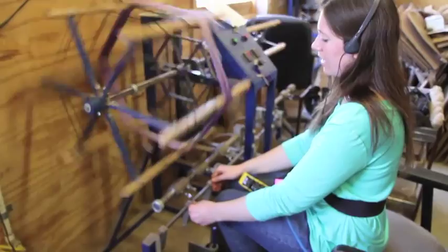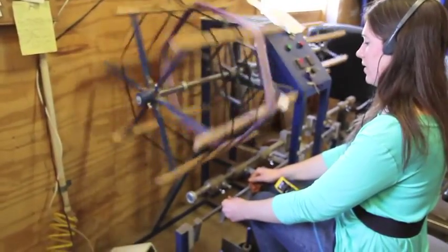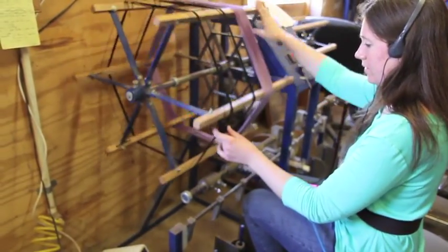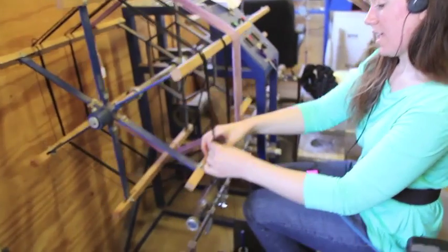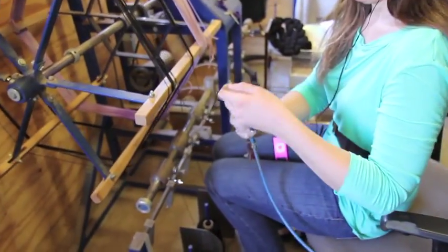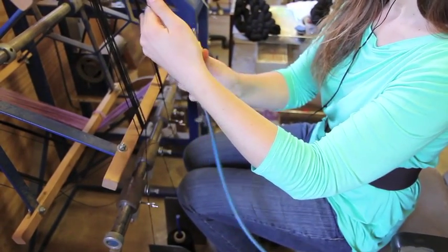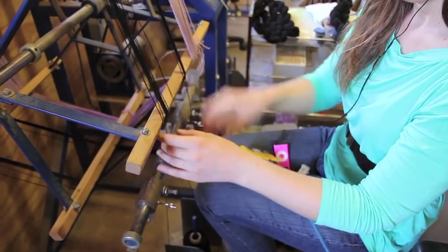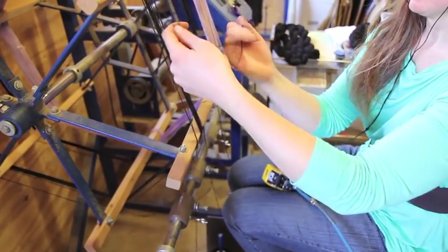Instead of being on a cone, which is what this fiber is, you can see the fiber coming up that she was wrapping and going across to that machine over in the corner. That's a cone. This is a skein winder where it's just wrapping it up and it'll constantly keep wrapping it. And what she's doing is she's looking for any thick or thin spots, any slubbings that's occurred. Somewhere the fiber has actually slubbed up. She takes this machine right here, which is called a joiner, and actually air spins it. So it will take out the slubby spot and rejoin the fiber back together again as one piece of yarn. So it did the same thing that this spinning machine did, except it did it with air inside of a little chamber. So it brought it together.